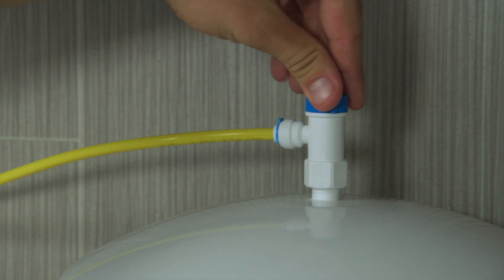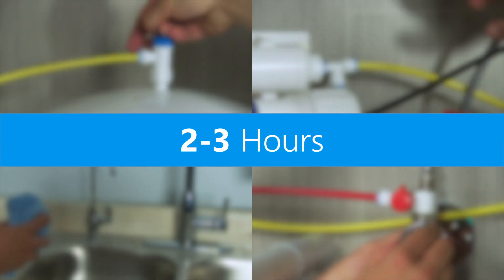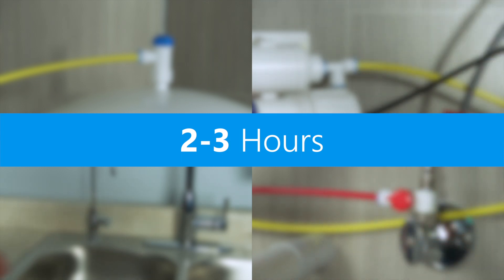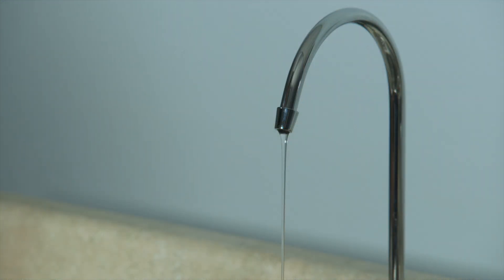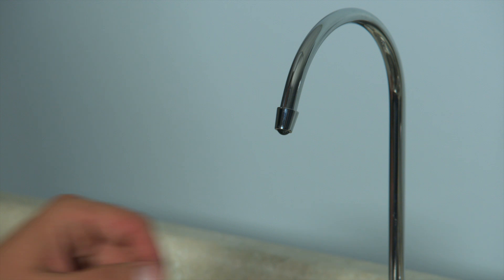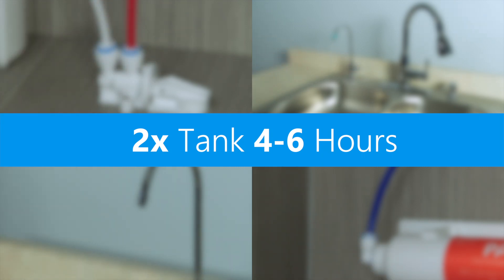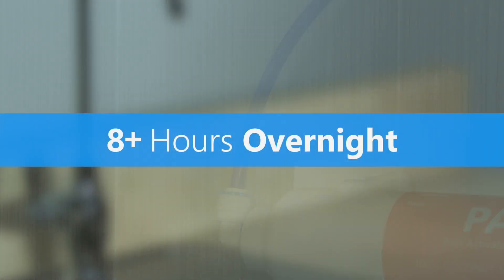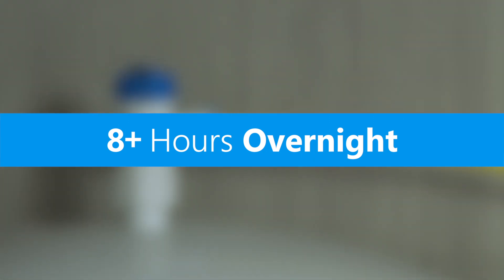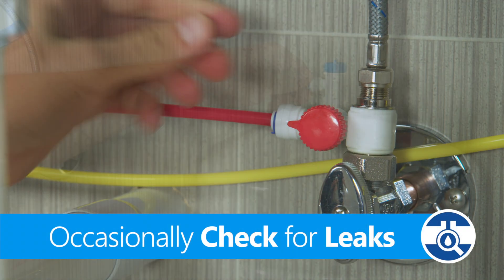Once you're sure there are no immediate leaks, turn the tank valve to the open position and allow the tank to fill completely. This will take between 2 and 3 hours — the amount of time depends on the pressure and quality of your incoming water. The flow of water will stop once the tank is filled. When the tank is full, open your RO faucet and drain the stored water. Once the water flow has slowed to a trickle, close the faucet and allow the tank to fill again. You should empty 2 more tanks of water to flush your system and prime your filters. This will take 4 to 6 hours. Occasionally check for leaks as you fill and empty the system. Now, let the system fill one final time and sit overnight before you flush again. Once the next tank is filled, your water is ready for drinking. Check for leaks occasionally during the first week of use.